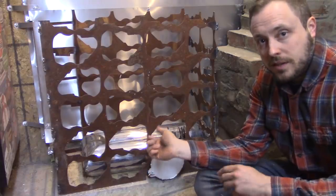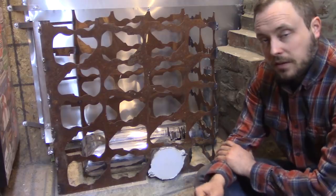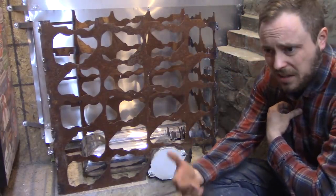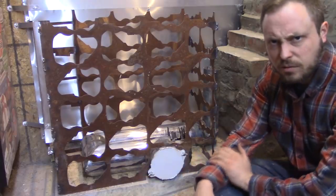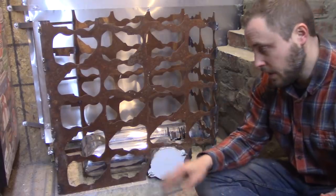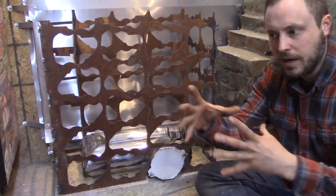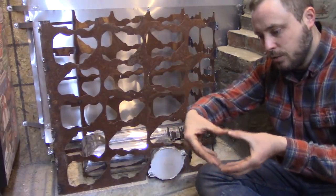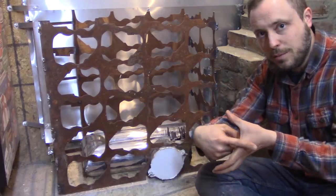This pipe at the bottom is 16 gauge steel, and it's round, and it's very strong. If I filled this thing with gravel and sand, it should only be like 3 pounds per square inch. I don't know what that is in metric, but there's not very much force and that thing will be fine. Plus it's round, so if it got pushed on the top, it would try to squish, but it can't squish because there's going to be material next to it.